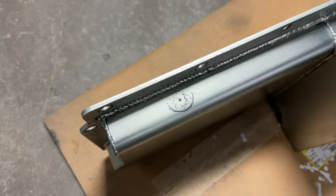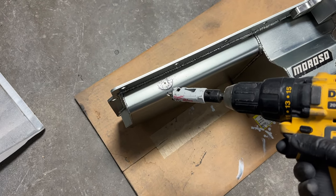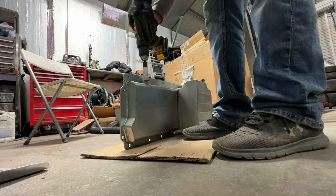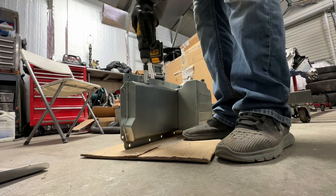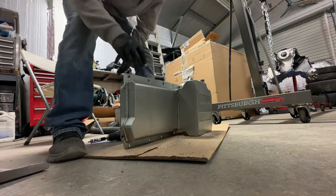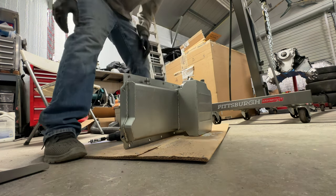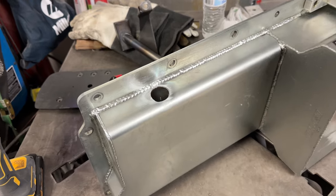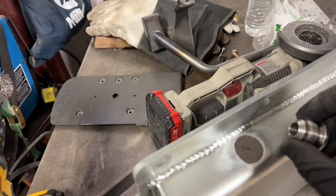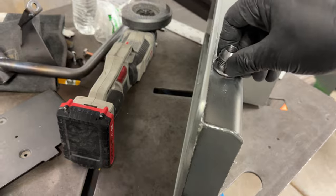I got my little center hole right there. I'm going to use a little hole saw that's close to the right size — hopefully I don't have to grind too much, but I might grind a little bit just to get it to fit right. Let's see if this goes in — I bet it doesn't, but it's probably close. Not quite, but it is very, very close. I got it as close as I could, then I took the die grinder and opened it up as much as I could too — so it's just right.